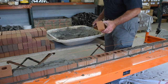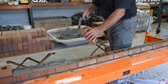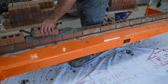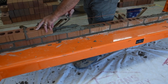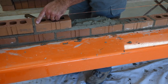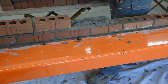Now we're going to show that process from start to finish. I've got my brick, I've got my mortar on my trowel. I'm going to butter this joint just like that right there — nice full joint. And then I'm going to lay this brick right into place, get it right to the line. Notice my full head joint, top to bottom, front to back. That's a nice, good full head joint — that's what we want to see applied on the job.